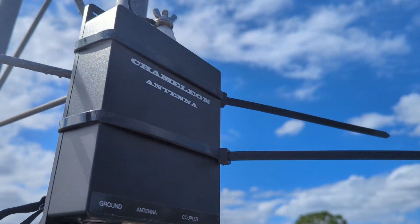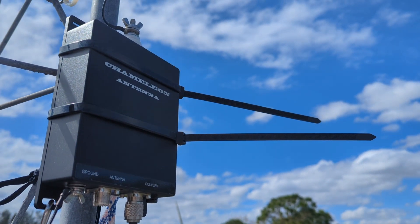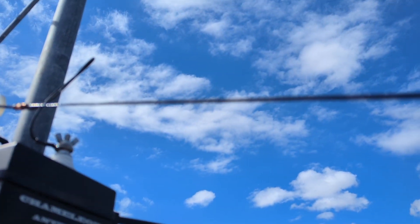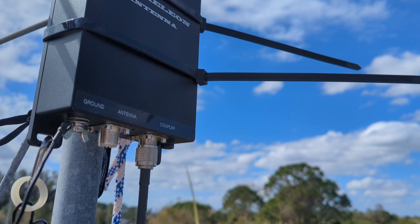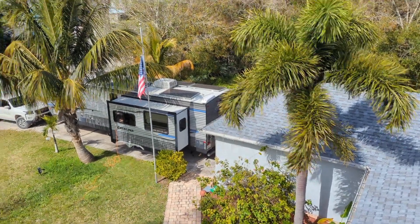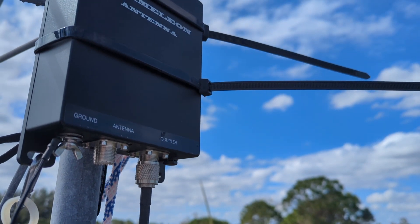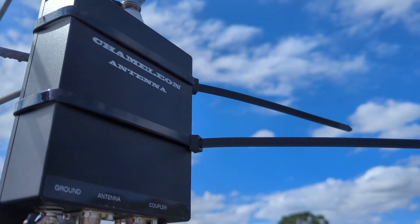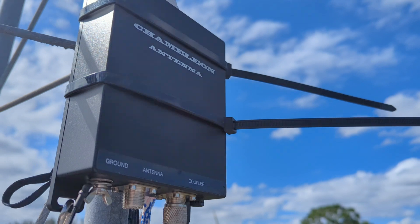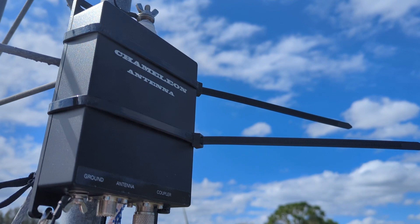The reason I chose this: it'll do 160 to 6 meters at 125 watts. It's got 16,000 memories, and it'll match this wire antenna from anywhere from 5 to 1,500 ohms — turning a piece of wire that's not resonant at all into something usable. This coax goes to the other end in the RV. When you use that coupler and push the button, you send a solid carrier into it, and after about five seconds or less it's going to tune. With 16,000 memories, if you go back and forth between bands, it remembers the capacitance, inductance, and resistance — and the motor switches and tunes it.